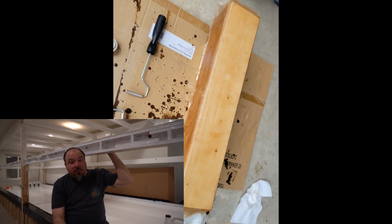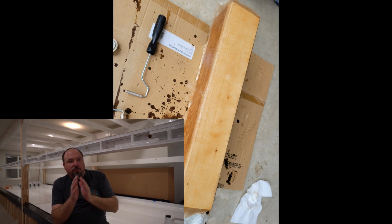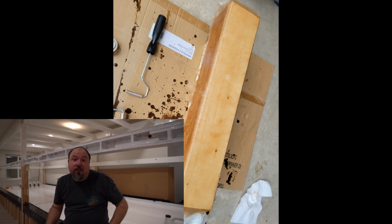I repeated this same process on my small section of top aquarium brace beam, and I found out a couple hard lessons with this testing, which is exactly why you want to do testing. I tried to take a single piece of fiberglass and fold it over 3 sides of the beam that were getting fiberglass. The chop strand mat will not do outside 90 degree corners. You could wrap it around and it'll look like it's going to hold, but it will start to flare out.